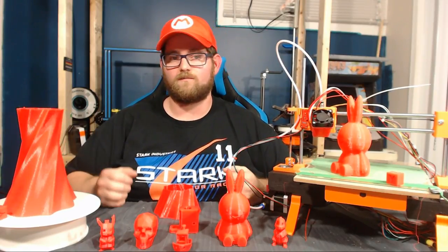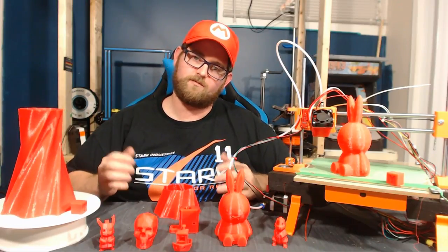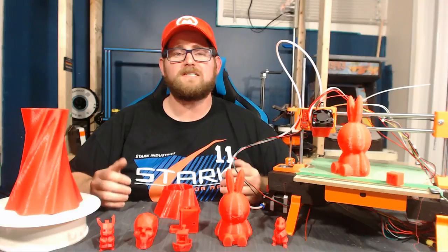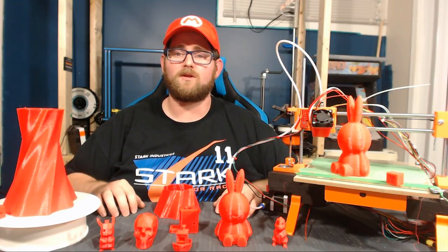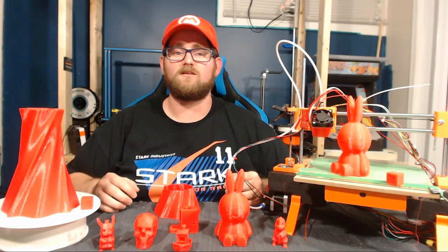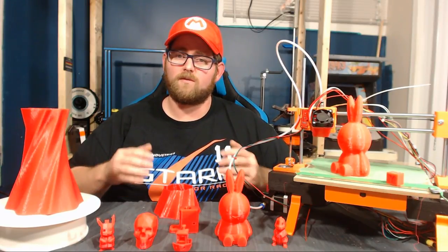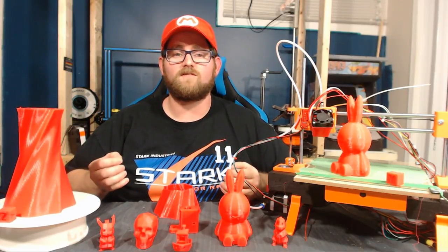Now let's take a look at the failures. I'd hoped to squeeze out some extra performance. The original machine claimed to have a travel speed of about 20 millimeters a second with a print speed of about 10 millimeters a second. While my X-axis was able to handle about 13 millimeters a second during prints, the Y-axis capped at just 9 millimeters a second. Even when the printer had no load on it, I was unable to hit the 20 millimeters a second advertised without missing steps. This may be a quality difference in the motors, so I plan to test out some different variants in the future.